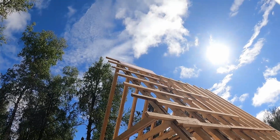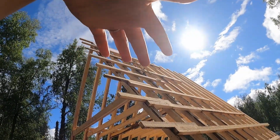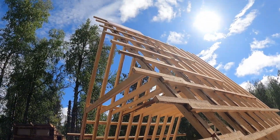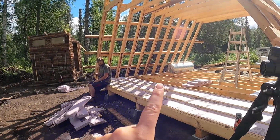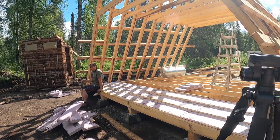So we got the purlins all the way up on this side, but we need to add some extra lengths so we can start putting some sheets up right here, because we're gonna have the sheets run this way, because that's gonna be the easiest for us to push them up and then actually be able to stand somewhere to tack them in. We did 1 sheet of insulation way up there, so once we get the rest of our purlins in, we'll finish off the insulation at least at the top. We'll put up some OSB, and then we do have some house wrap that we can throw over top of that to try to keep the weather off of it for the time being. But really it's just get this figured out and move all the OSB over.